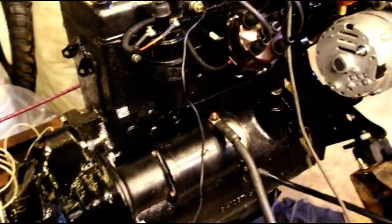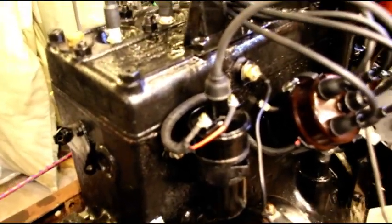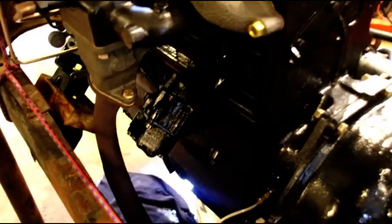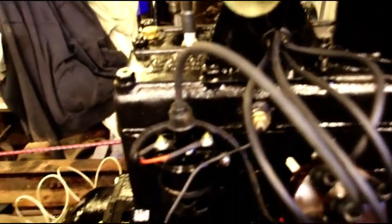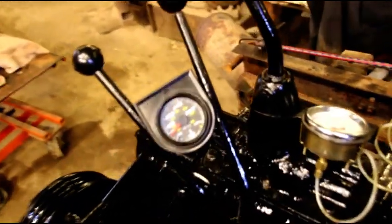The next one should be normal color, but sometimes there's just a little residual left — don't be alarmed about that when you change the oil. About after your first hundred miles of driving, I would change the oil again. I set the valves just a little bit loose on new engines — get in there and adjust your valves after your first few runs with load. It's better to adjust them so they're just ticking a little bit so they can breathe and get rid of the heat. On new engines I always do that. With older engines like this you're going to have to be adjusting the valves anyway, so just get used to it. After the first few runs, adjust them and you'll be good probably for a year or more.